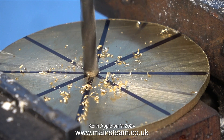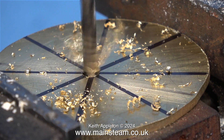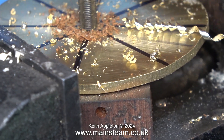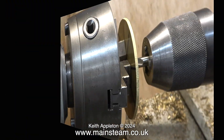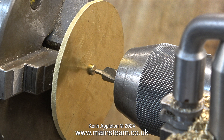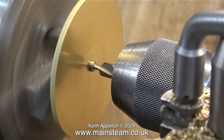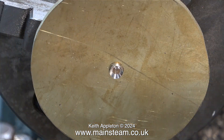In this clip I'm committing a grievous error. This part ended up not being in the centre because I didn't use a centre drill and the twist drill wandered about — and I'm doing it on purpose. I drilled the hole tapping size for quarter by forty, threaded it quarter by forty threads per inch, and screwed in a quarter-by-forty boiler plug. I gripped the boiler plug tightly in the chuck jaws and then using a centre drill I drilled the other end quite deeply.